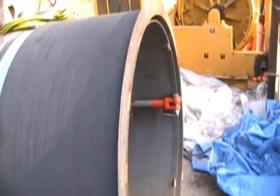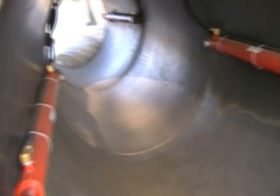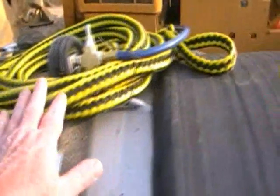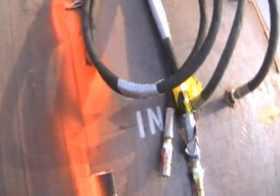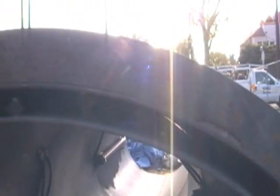As you can see, the inside is wide open. It's got an inflatable rubber bladder on the outside and hydraulic cylinders on the inside to move the flow diverter out into position once the entire unit is lowered into place. There are hydraulic hoses and an inflation rope and hose at each side to operate the flow diverters. The flow diverters have a rubber cuff around the diverters and the pipe to seal the liquid from coming out between the pipe and the flow diverter.